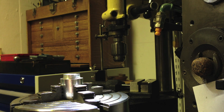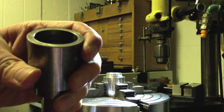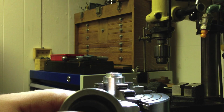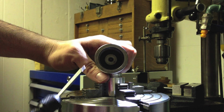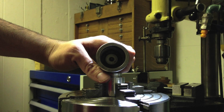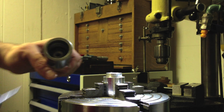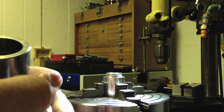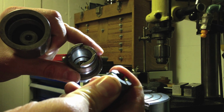Okay, so this is a Clarkson Auto Lock cutter holder, and there's a kind of collet here. We've got this shell with a 3 Morse taper shank, a little spigot in there. I don't know if that's visible. There's a little spigot inside there. Sorry, there's not much light in this shot. And some threads, and this body threads into there. So, and it's got a tapered nose, and similarly it has collets, and so that taper squeezes the collets.